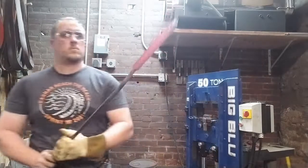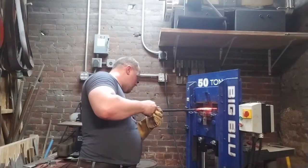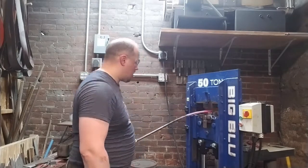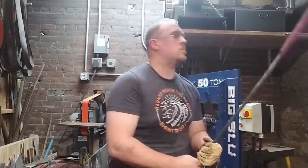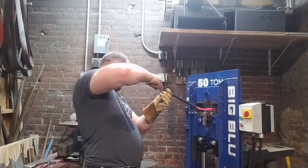Modern knife smithing techniques have completely eliminated a lot of these stresses from the process, but that's not the objective. You can't get historic results without at least a few historic techniques. So we're going to be drawing out gently with a gently curved die.